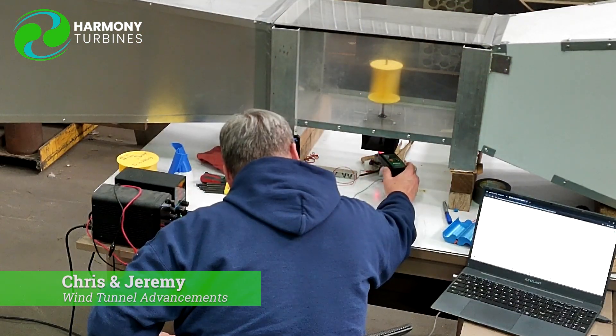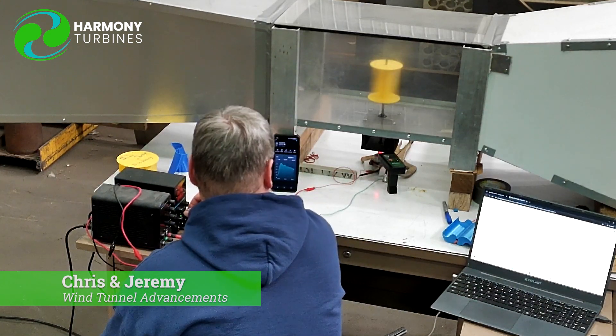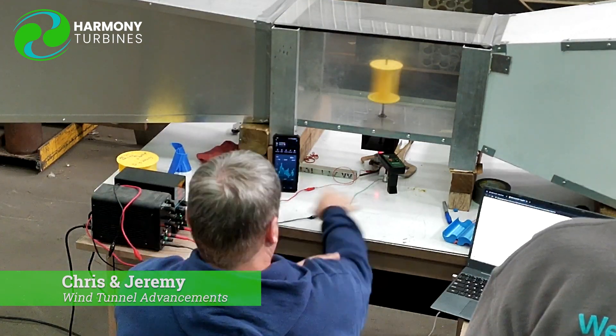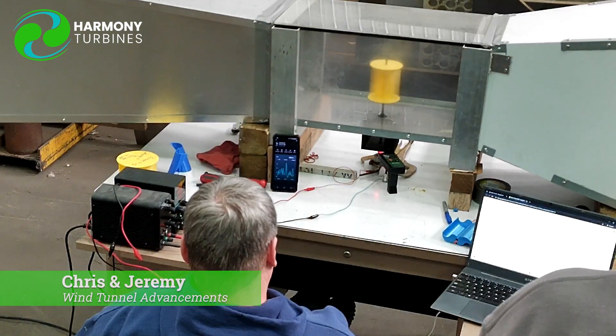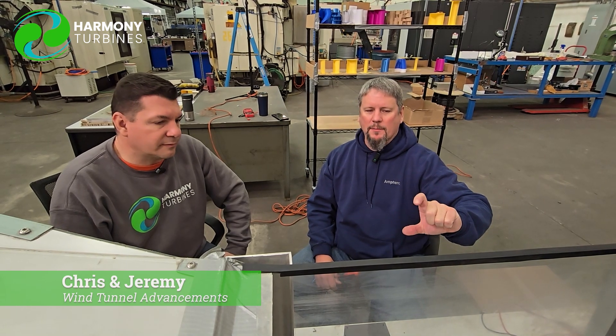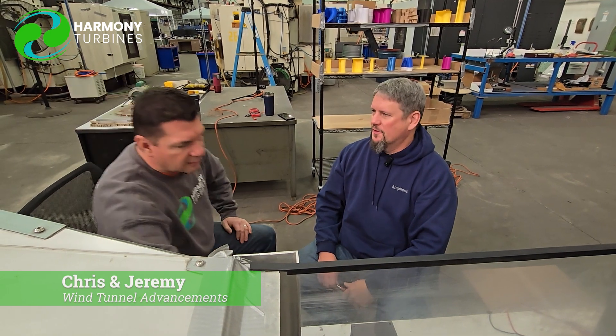The old motor was actually inside the box, so the box was a little larger. Now we're mounting underneath it, so we need a shorter box. We're putting a larger motor on, and we need a little bit more room underneath. That meant we had to redesign our bearing block to mount the motor, because we were just limited on space.